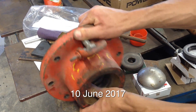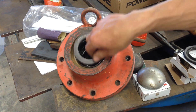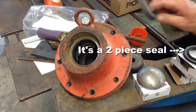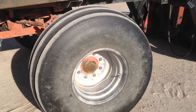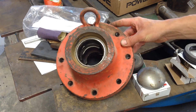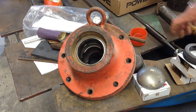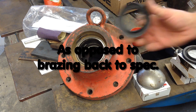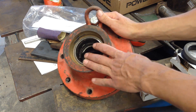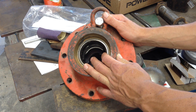A customer brought this hub in — wheel bearings went out and it needs to be machined so the seal fits again. There's a little bit of play in there. This is on the front axle of a tractor. I'm trying to figure out how I'm going to put this in the lathe and spin it down true first, then probably build a bushing to fit in there, since it just has to hold the seal. Of course, it's six o'clock on a Saturday evening and I am dog tired.